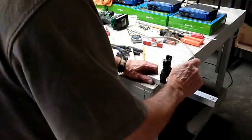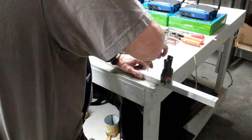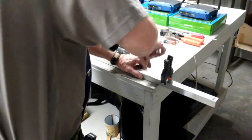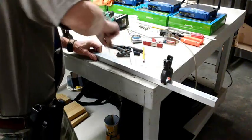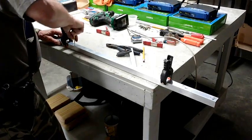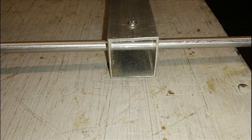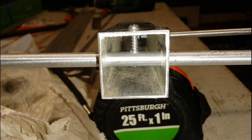I am using the same technique with the automatic punch to punch the pop rivet holes in the top of the boom. These holes are directly over the elements. As can be seen in the photos, I ended up using three-quarter-inch number-six galvanized screws instead of pop rivets to hold the elements into the booms. This makes it easier if you ever have to remove an element from the boom.